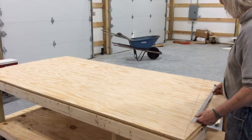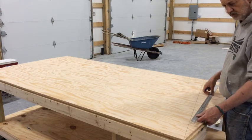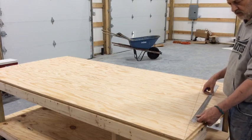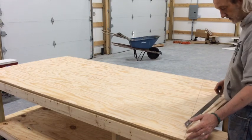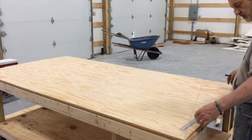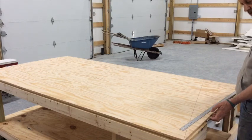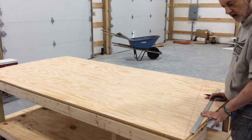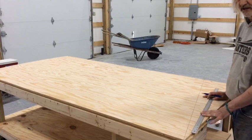It's supposed to be 50 inches from the top down the back of the transom, down the rudder post, down to the keel. It would be nice if it was 48 inches because then we could just use the width of the plywood as our straight edge that would attach to the back of the boat. But it's 50 inches — I've measured it a couple of different times and there's nothing I can do to change that. If I make it 48 inches it's going to be a little short, and I just don't think it's a good idea to stray from the plan.